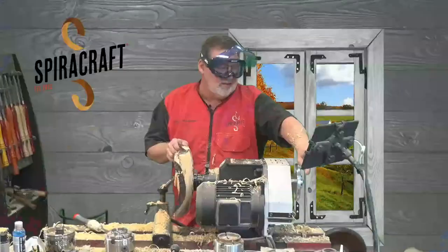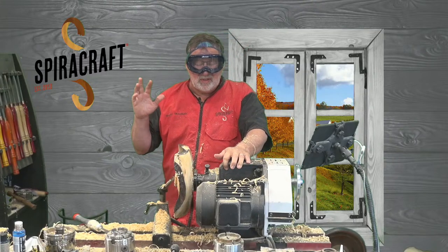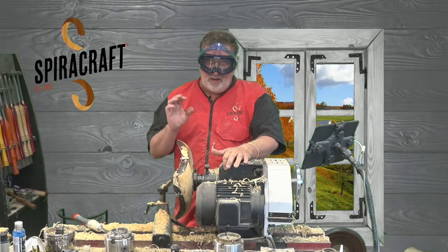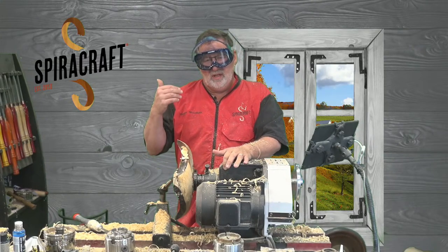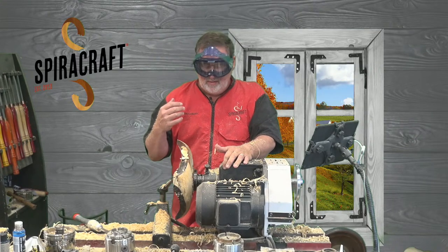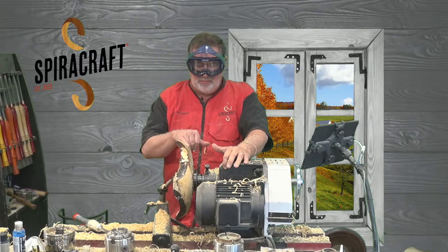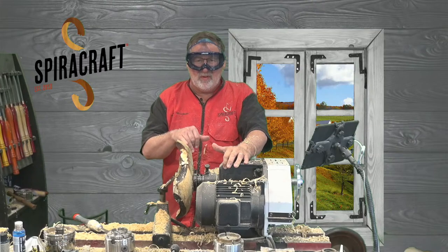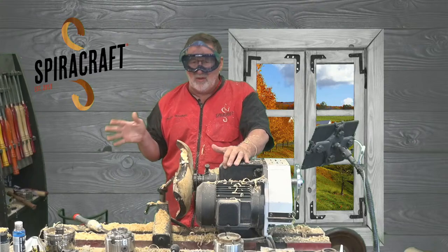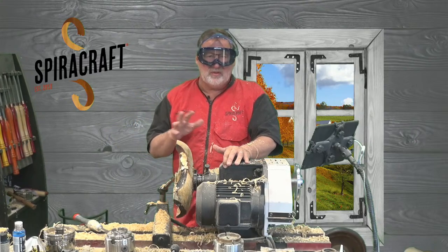So I will be listening. And I talk about this a lot. This is why I don't play music when I'm turning. I love my music, but this is one of the things I preach. I like things to be quiet because I want to hear the pitch of the wood as the tool is cutting it. If that pitch all of a sudden starts to change in a way that doesn't sound typical, if I get an atypical sound, that tells me that the point I am aware of is starting to come loose. And if you start to hear a certain type of tick, it's time to step back, turn off the speed, and reevaluate. So always be aware of something like this when it starts to show up in the piece.